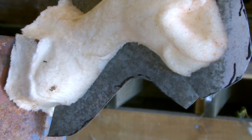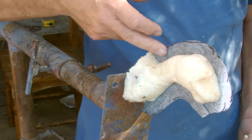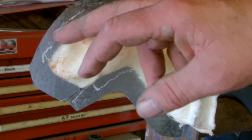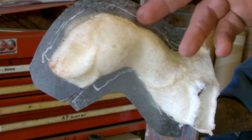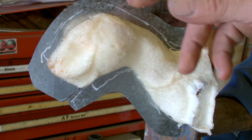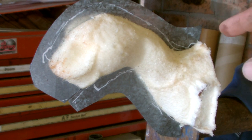This technique will work on molds where you need to curve the tin, not just on ones where the flange line is dead straight. It's easy to make a flange on this mannequin because you can put the tin into the soft foam. On a solid object where you couldn't do that, you would temporarily glue the tin to the object — perhaps with body filler — mold the other side in fiberglass, then remove the glue and the tin and mold the second side. This technique works on things as large as a life-size grizzly bear.